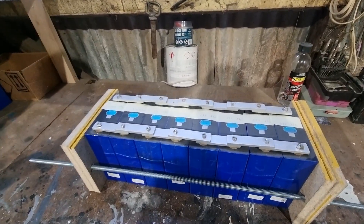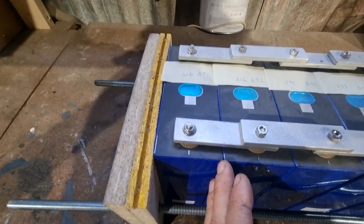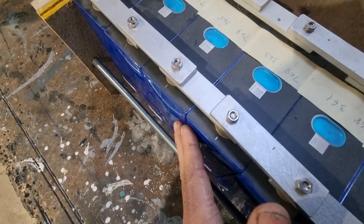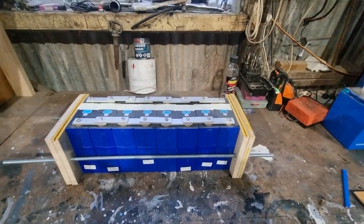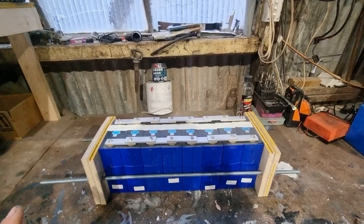It's been several days since I put this battery in the clamp. I removed the piece from the center in order to install these bus bars and added a piece of timber at each end because the timber was starting to bow a little bit. The cells have compressed back into a reasonable shape — the gaps in between each cell have basically closed up. The threaded rod is under a fair bit of tension and some of the cells have started to bow out the other way, so I don't want to put them under any more tension. I've put the charger on them and topped them back up to about 3.2 volts, so I'm just going to leave it at that for now. I don't really have a way of telling how damaged this pack is — I'm just going to have to install it and see how it goes.